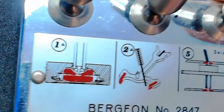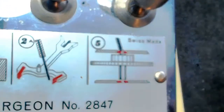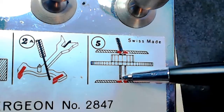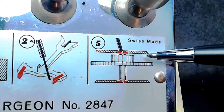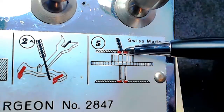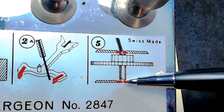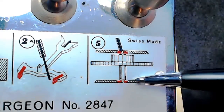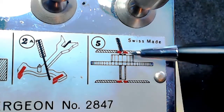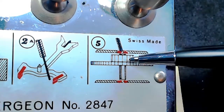There's a cool diagram showing a gear coming up through here with a shaft and pivot on the end. You're oiling the jewel on top — the cup of that jewel. You don't want oil to get onto the gears at all. It's really not necessary to oil the gears, because if you do, the watch will just collect dust and other debris caught in the gears, and then you've got problems.